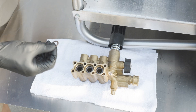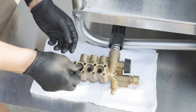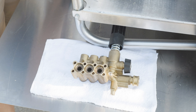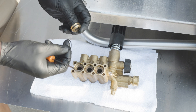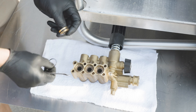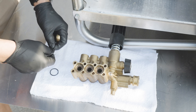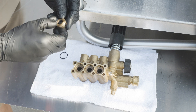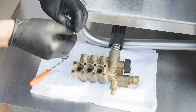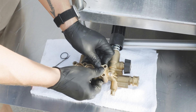Now that we have our high-pressure seals in, it's time to insert our spacers directly on top. Then we're going to put our seal retainers in, but first every kit comes with a new set of o-rings that go around our seal retainers, so we'll want to remove the old o-ring and install the new one. Take a pick to move the old ones off, then use a dab of grease before installing the retainers into place. Those should seat down just like that.